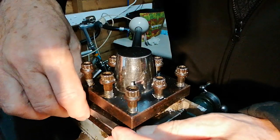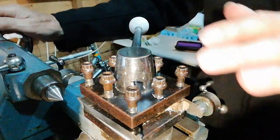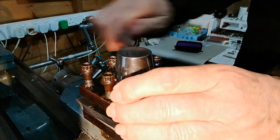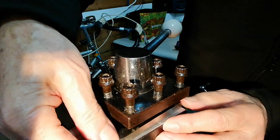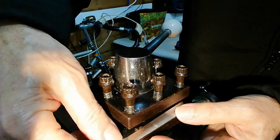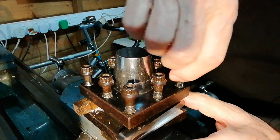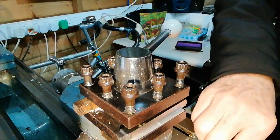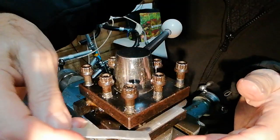What I can do now is locate it in its position. I've done with the dead centre on the tail stock so I can slide that out of the way, and then bring the tool post into the position I want it. I'll put it there and then we need to clamp it firmly in position with the clamping screws. We want to put a little piece of packing on top of the cutting tool.